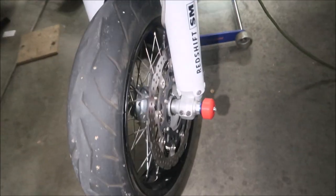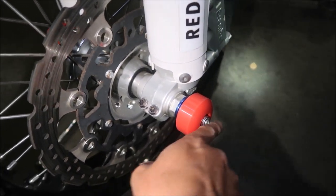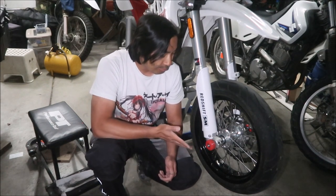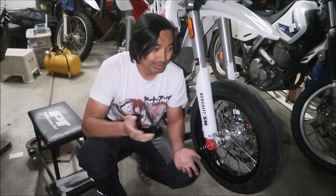You can also use a skateboard bearing in there, but then the nuts will stick out a lot. Use the acorn nut since it's smooth. If a little bit of thread sticks out, that's okay. That's it — we've made the front axle sliders for an Alta Redshift SM. This cost about 20 bucks, whereas a professional set would be 50–60 dollars. It took about two hours to fabricate, plus hardware store trips, but once you have all the ingredients together it's not bad.